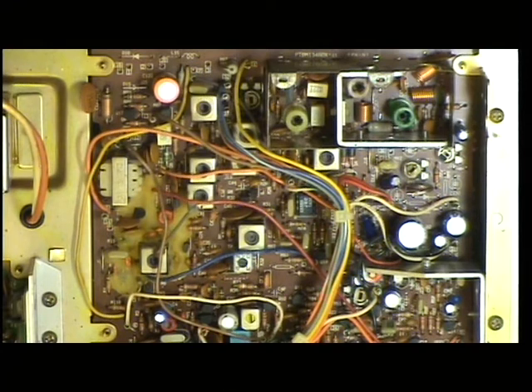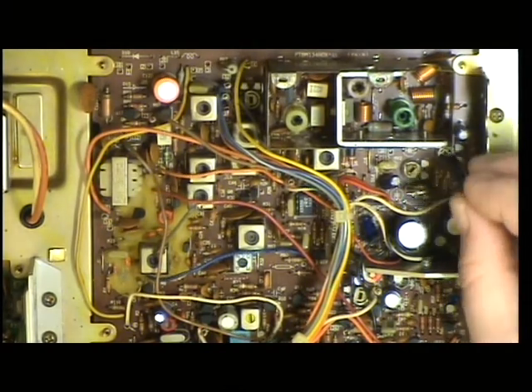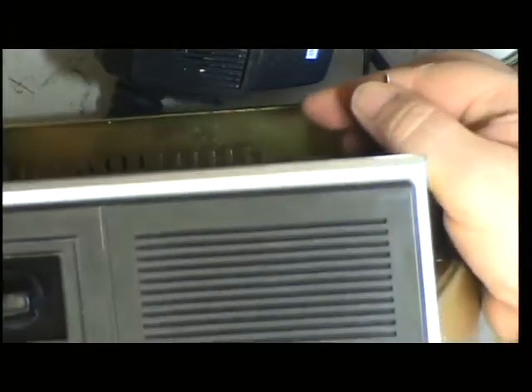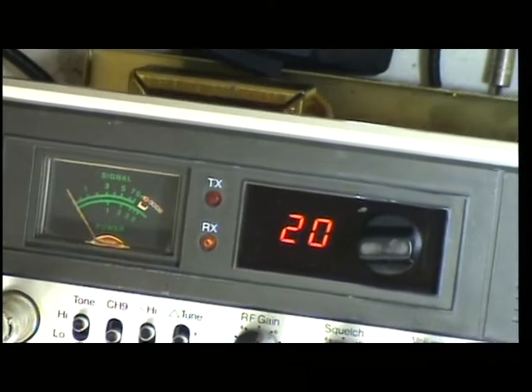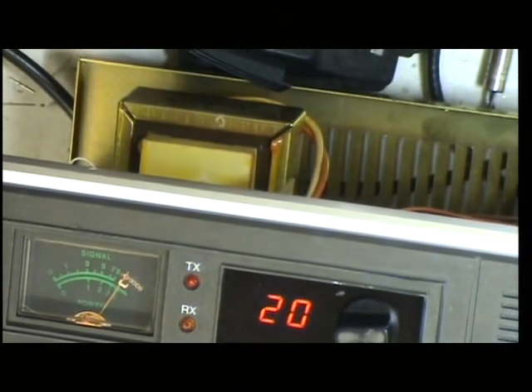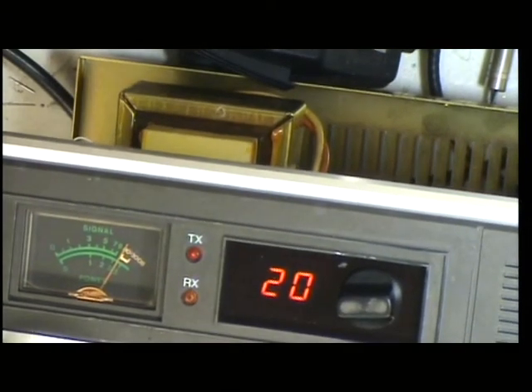The next thing I'm going to set up is the S-meter, the RF meter, whatever it's called on the front. It is RV4 that I'm looking for. RV4 is that one there - you've got the 2 for the deviation and then the 1 back there. I'll just tilt this up so hopefully you can see it whilst I adjust that. And that's in between the 3 and the 5 from my view.